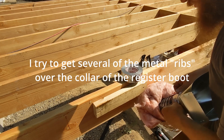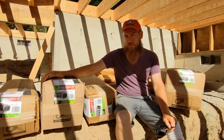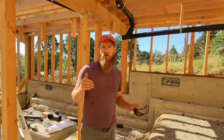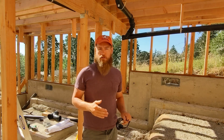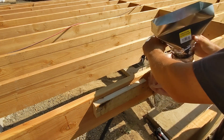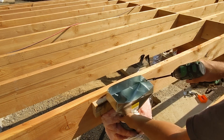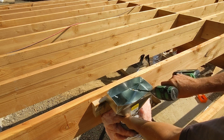We're going to go ahead and run these branch lines — these supply runs. The interesting thing is that you go online and find what's called a Manual J calculator. Manual J is how HVAC technicians figure out how much air volume and airflow, and therefore what main unit you need to run your HVAC system, as well as what the branch and supply circuits are going to be. I ran a Manual J calculator online and it was — possibly user error — but it was throwing back these huge supply circuits I've never seen that large. For example, it wanted me to run an eight-inch or larger supply flex duct to a seven-by-ten utility room.